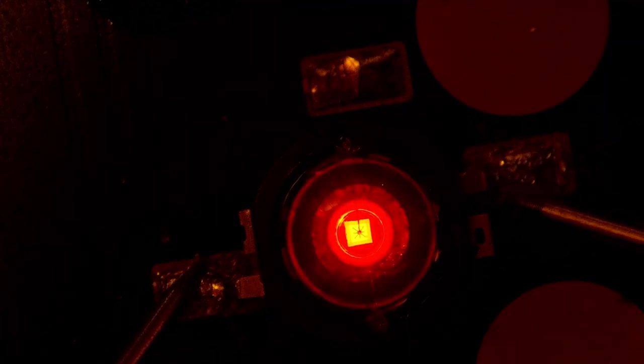I'll get the other one out and we'll test that one — this is the second one we tested. These ones look okay — they look better. Look at that, it's a red LED, which makes sense because it's coming from the red light. So that means these LEDs are good, potentially. Let's test them all. Yeah, look — this one lights up and this one lights up. Perfect. Let's head over to the next one. Nothing there — let's reverse our leads. And look at that. This board is good.